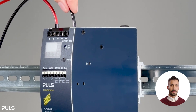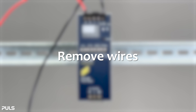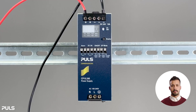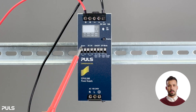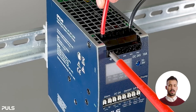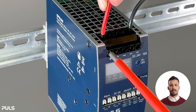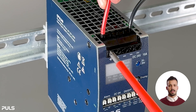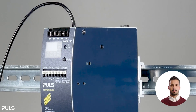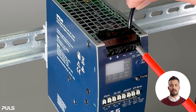These wires are now securely clamped in place. Now let's take a look at how we can remove the wires from the screw terminals. Simply take out the wires one by one — turn the screw counterclockwise to open the terminal. Open it wide enough so that the wire is no longer tight and should be easy to pull out. Repeat this step for each individual wire until all wires are removed from the device.